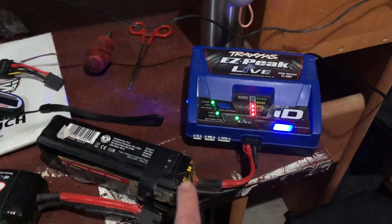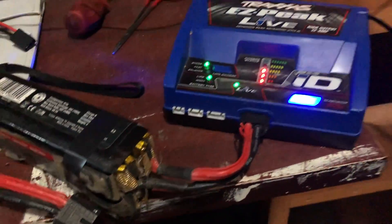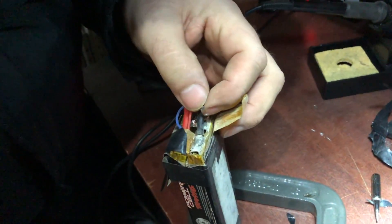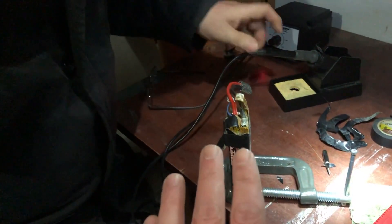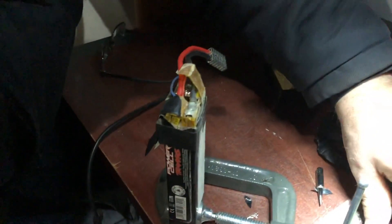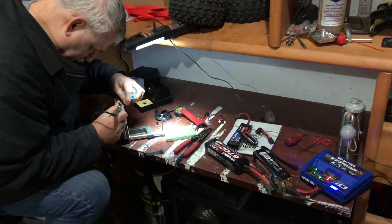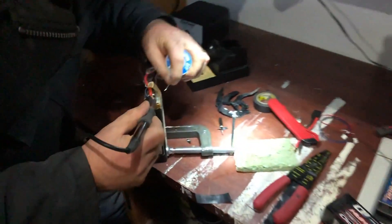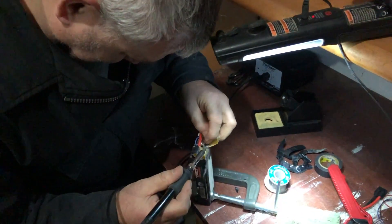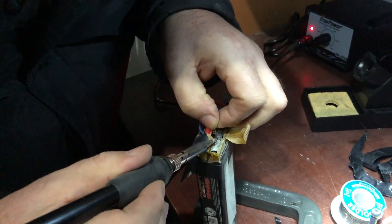Frank has proven to work his magic. We have one ID battery which has been re-soldered — there were two breaks on cells and he safely peeled them back and re-soldered on a red and a black lead, and we've now got ID charging working. Working on the other 4S LiPo — actually, this one is the 2S that had the balance lead completely broken off and missing. I've scavenged a balance lead off of another wire and we're adding it in now. Thank you very much to Frank from the TankRC — go subscribe to his channel and check out what he can do with RCs.